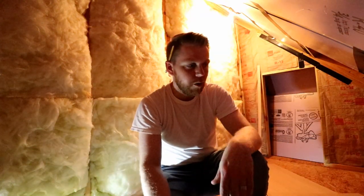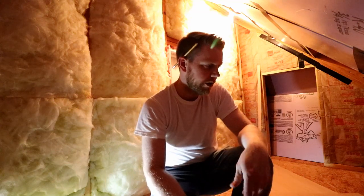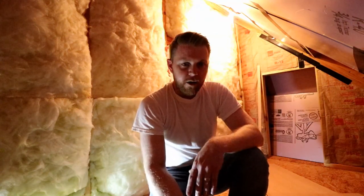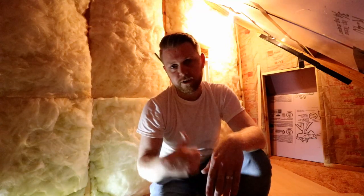I took some measurements on the door opening and I thought with how pliable the quarter-inch Luan was, I'd be able to flex a four-foot wide sheet and get it through the door and then bend it so it didn't hit the insulation. However, that was not the case. So I had to cut it down to a two-foot wide strip, which matches the stud spacing in the wall.